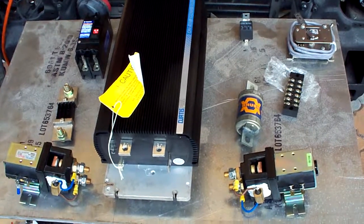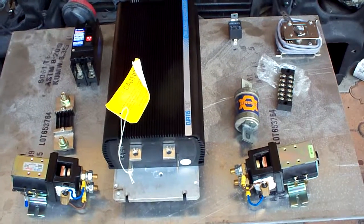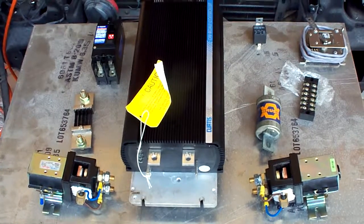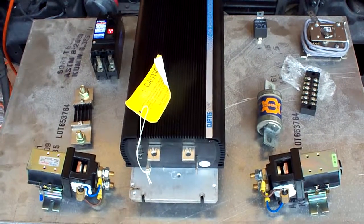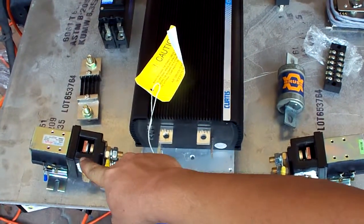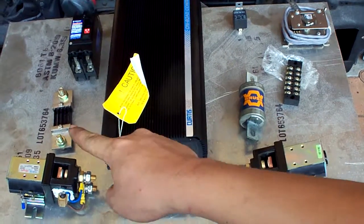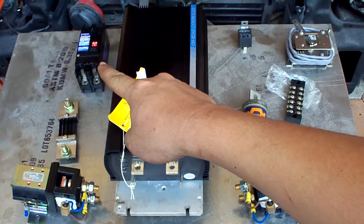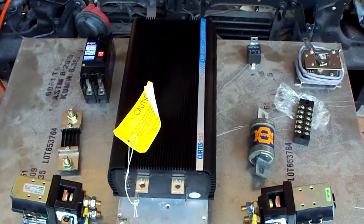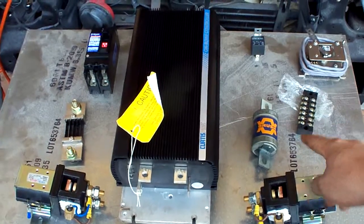With the motor installed and tested, the next step will be to figure out the controls part of it. So all the stuff required for the control is here: main controller, contactor, the slow acting fuse, shunt, a phase breaker, a relay, and the pot box plus a terminal.